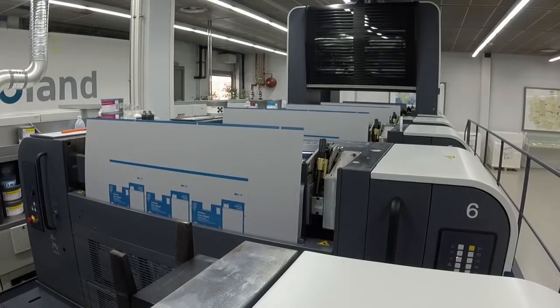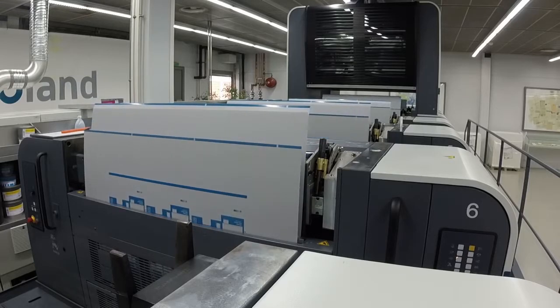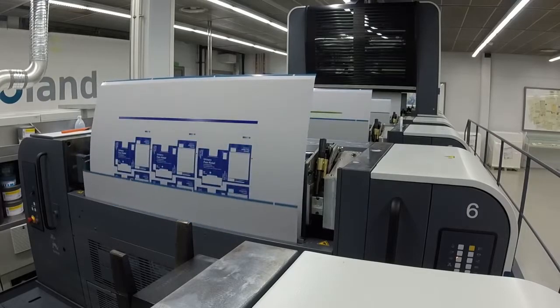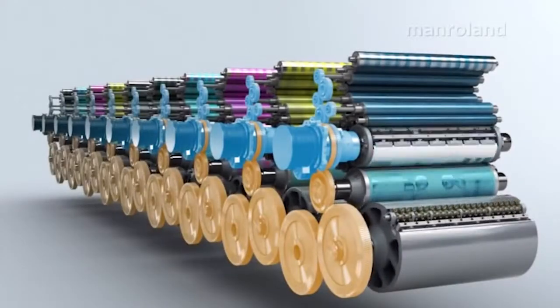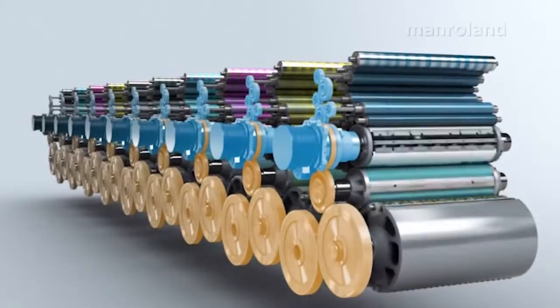Equipped with SPL, which stands for Simultaneous Plate Change, the ability to simultaneously eject and load plates in under 1 minute while washing up the blanket and back cylinder during the make-ready process converts job changeover times to a mere few minutes. Further capabilities with the option direct drive system further increases efficiency with the availability to wash up the ink train system.